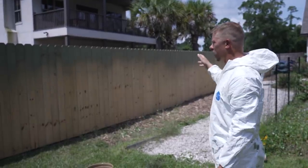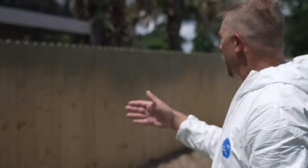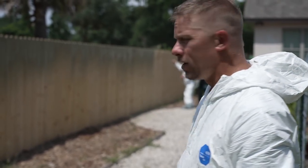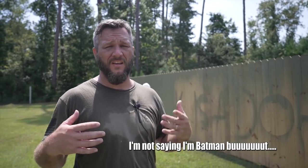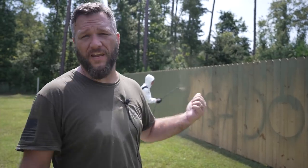You could do this with a brush, and if you're close to a house you probably want to hand-brush four to six pickets right up by the house, then spray from there. If you're close to something you don't want to get stain on, use soapy water — if it's a porous material like the house siding, keep it wet while spraying and rinse it off after. On non-porous surfaces it won't stick. You don't need a full Tyvek suit — old clothes, a mask, and safety glasses will do.